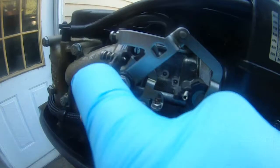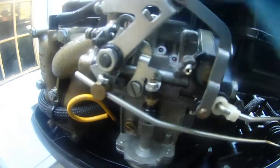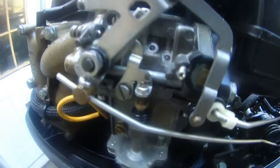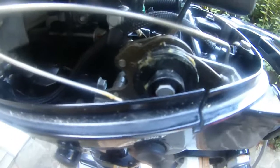Because this link arm actually just pushes back, and then this throttle arm actually goes forward. When this throttle arm goes forward, the motor speeds up. When this arm goes backwards, the motor slows down. And then there's a stopping screw over there. Do it again — forward, faster, slower. And then until this thing gets back to a certain point, it will change the gear to neutral. That's neutral. Pretty simple.